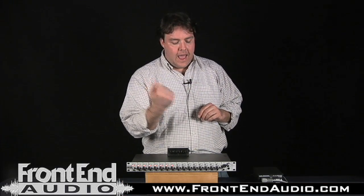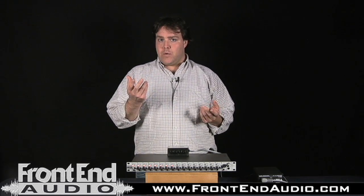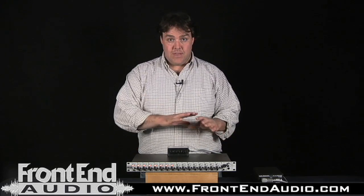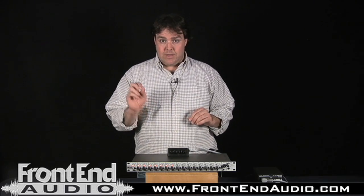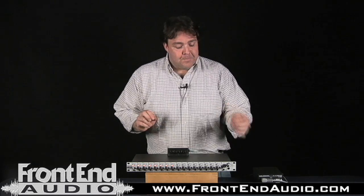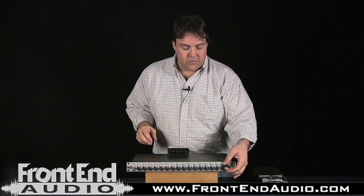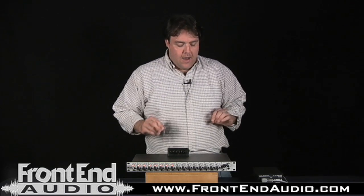The outputs on the back are a pair of quarter-inch TRS outputs. One of the things about this box too is everything is completely balanced all the way through. It's a really unique thing, and we'll talk about that in a minute. But those outputs on the back are going to be controlled level-wise with this master fader here.